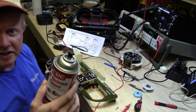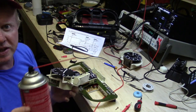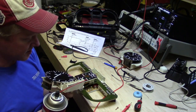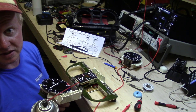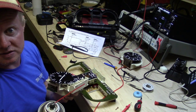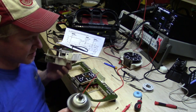A little bit of electronic cleaner generally will clean most of the surface stuff off. I still recommend just making sure the pins are actually tight, and lightly going over each pin with something abrasive to actually clean off any oxidation and get a good connection. If you have it, now is a good time to put on some DeOx or some kind of protectant that will actually prevent oxidation.